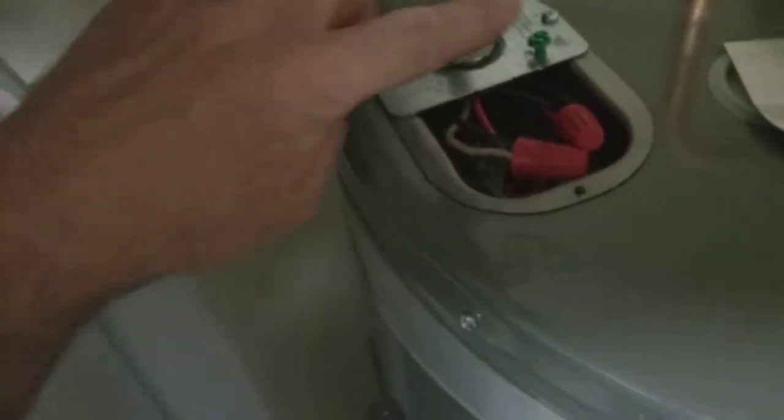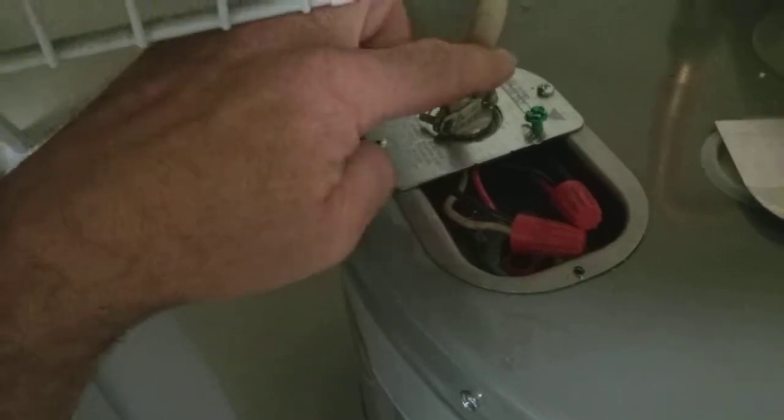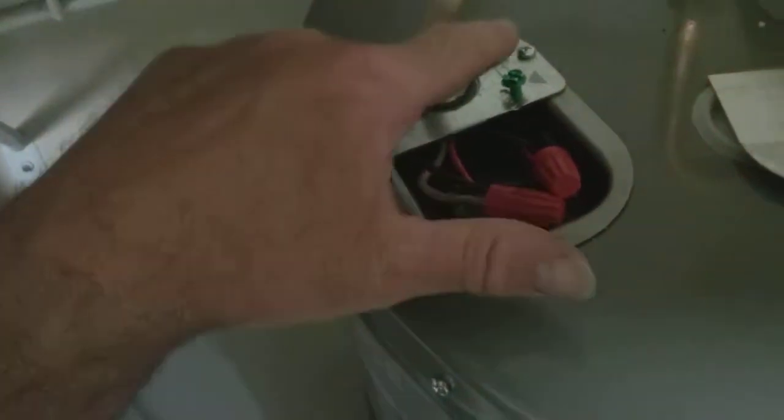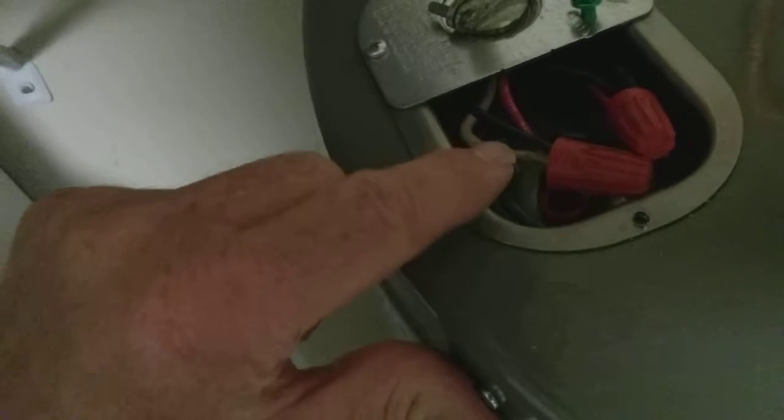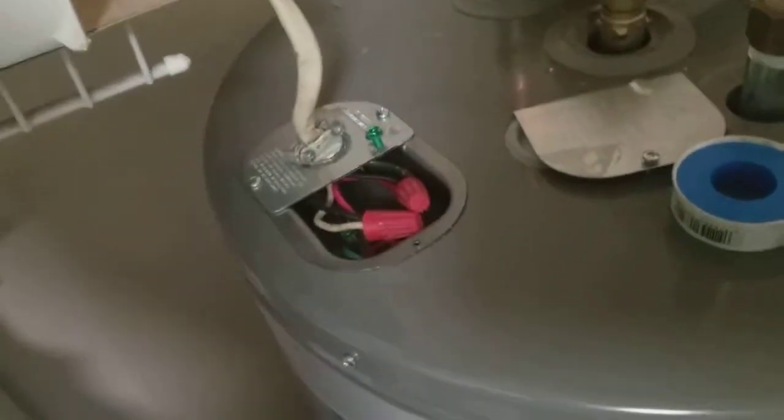Okay, here's the wiring. So it's black to white and brown to red. And then green, actually on this one, it had a screw on the outside to put the ground wire on. But since my ground wire runs in this and comes out with the power, I just went ahead where there's a ground wire inside that hooks to the inside. Because what they would have it set up for is if you run a ground wire to this, it's grounding off this whole box, and then down inside there's a ground wire that goes inside to where they need it. And instead of hooking this up and just going through there, I just went ahead and screwed it onto that one down there. So yeah, black to white and red to gray, kind of a brownish gray, and it's pretty simple.